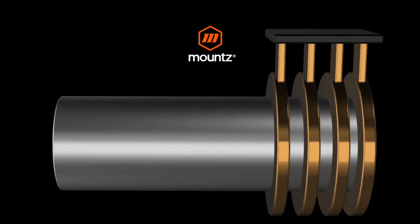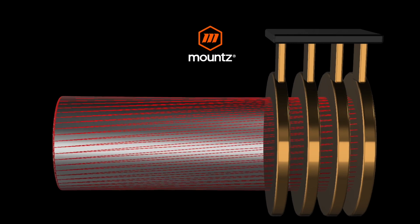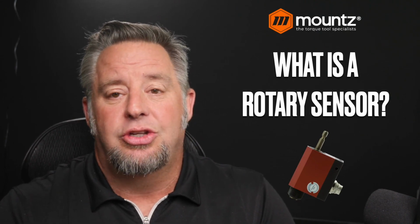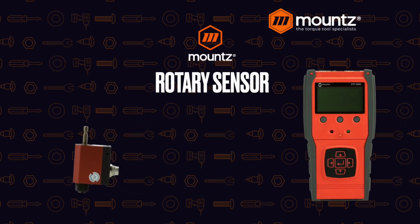Now, in the rotary sensor, we use slip rings that are over the strain gauge, and we can measure the difference between the different slip rings, and this will then provide us with the torque that is being generated with the power tool. And so this allows us to put the rotary sensor basically in between our tool and our part, and then we can measure on our application what the actual torque is.